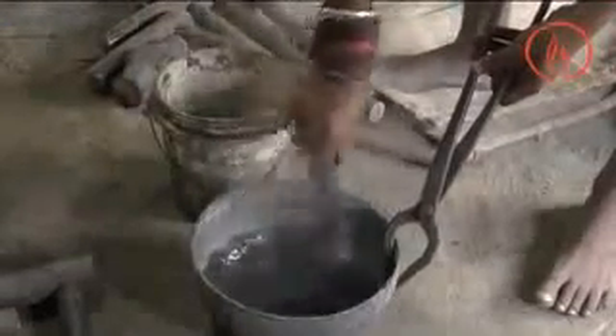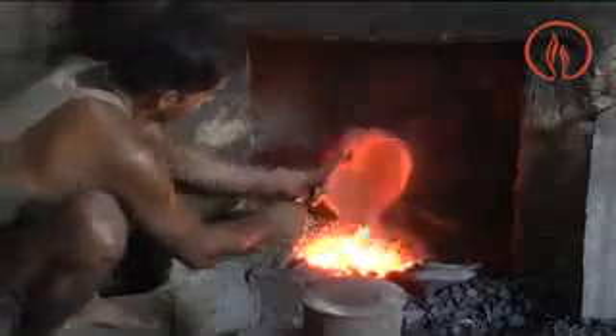The bowl is wiped with a mixture of water and Himalayan salt. The salt makes the metal softer and easier to work with. Because of the salt water, the bowl now produces more smoke and the flames become bluish because the temperature increases. The bowl is cooled in cold water at the end of the hammering process.